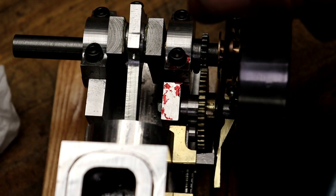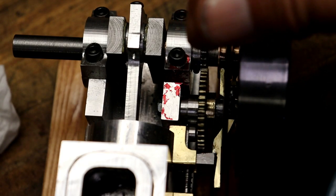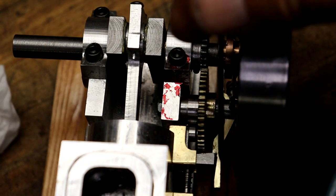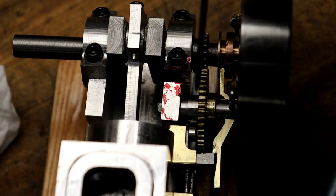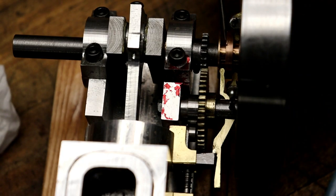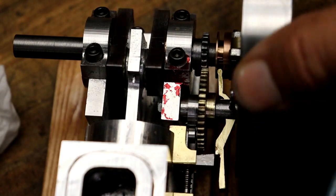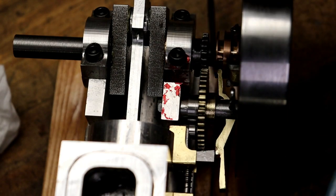This one when I came in and milled it I got it at a little bit of an angle, which really doesn't hurt. This whole lever doesn't need to be that long - it could be cut off right there. So on my set of drawings and PDFs and my model I'm going to cut this off and try to get some of these dimensions and put them on my drawing so that if I ever want to make another one I don't have to fiddle around - I'll have the dimensions correct. The spool back here I made just a tad loose, and that was enough to where I didn't have enough to engage and disengage - so all of this is kind of done now.